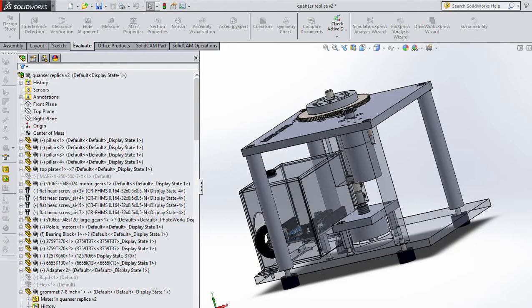So what I would do is take this 12 by 12, take a scribe. Have we showed them the scribe? And I would scribe out your cuts. Now, if this thing was going to be 6 inches by 4 inches, would you scribe right at six and right at four? You'd give it a little bit extra, right? So if I were you, I would probably give it at least 30, but probably 60 thousandths extra on each side. But coordinate with the second group and carefully scribe this out before you cut. You've heard measure twice, cut once, right? Take that to heart. So this is kind of the layout you're going to use to make sure it all fits. You got any questions there?